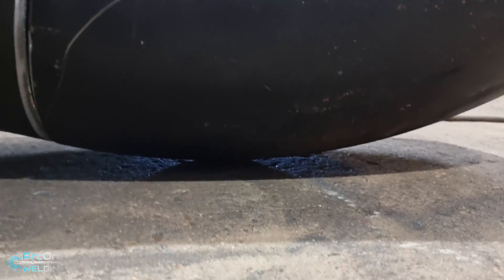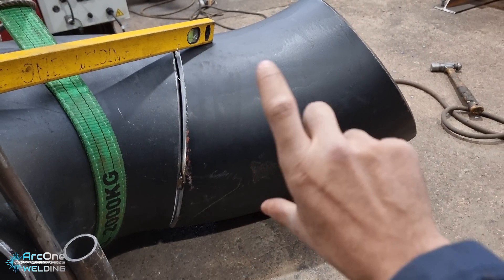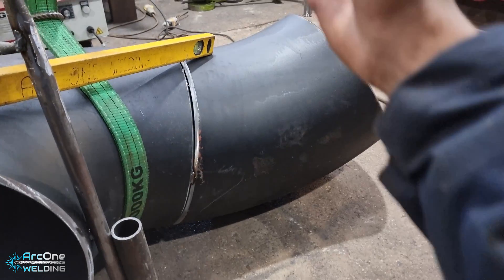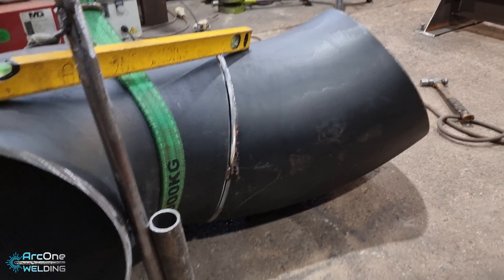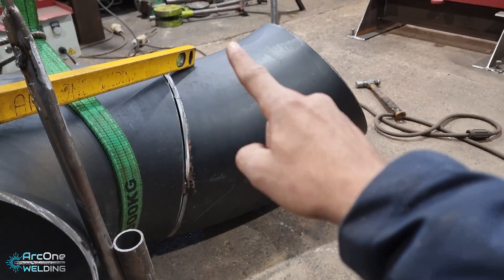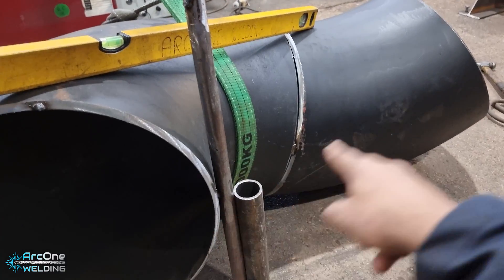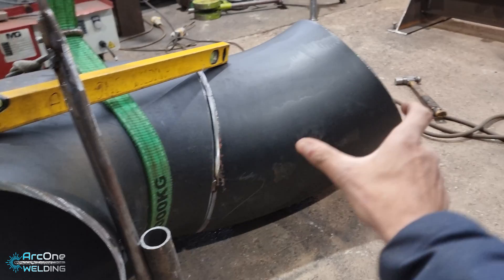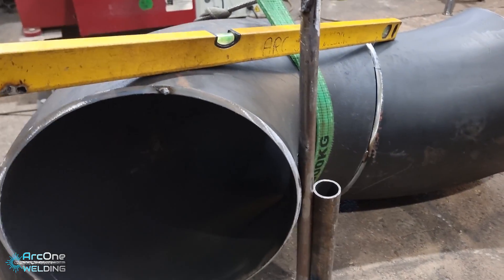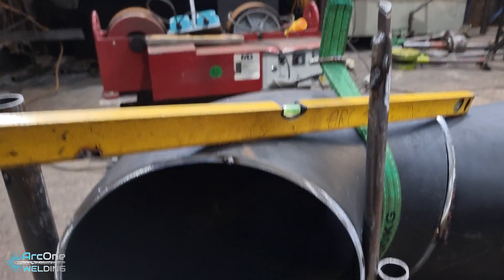I have a torch on the other side, and as soon as you can see where the elbow touches the floor, that's the part I cut. Providing the cut is straight, you can imagine a piece of pipe coming off straight and level with the floor, butting up nicely to give the pipe the correct set. So I'll cut it, retake the measurement, then add whatever extra sliver of pipe I need to get the center-to-face measurement. I'll probably weld it on the manipulators as well.